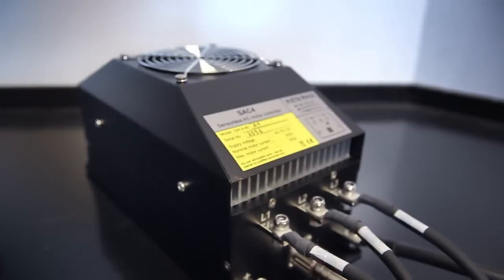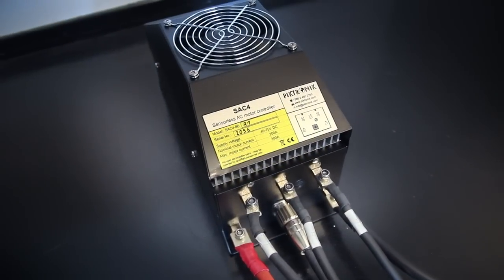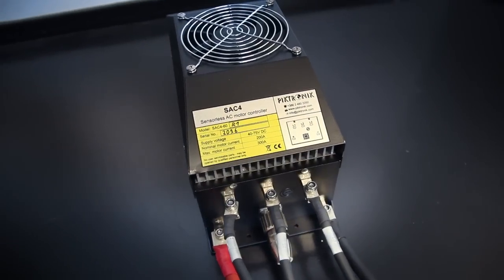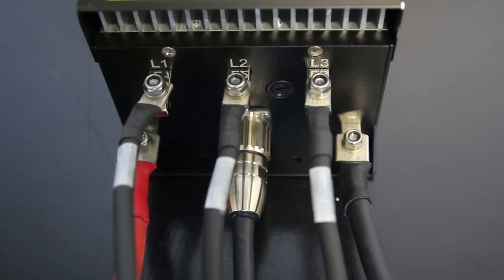The motor controller is placed close to the motor. Secure some free airflow for the air cooling of the unit. Make sure no falling items, such as tools, will touch the cable connector points if dropped within the same compartment.